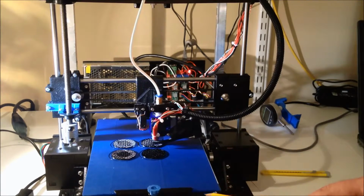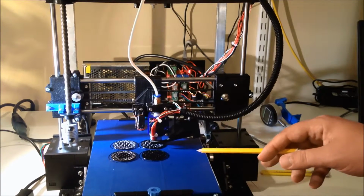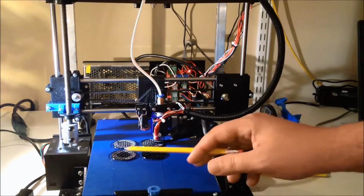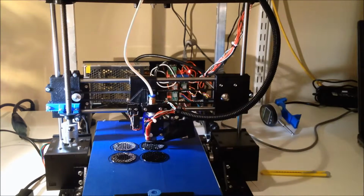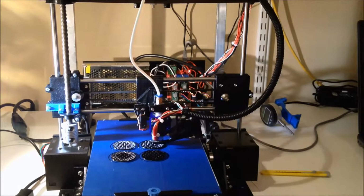I still have the problem that this melamine is warped in the middle a little bit, by about 0.3 millimeters, so I do have a sheet of cardboard in the middle, real thin cardboard, to kind of boost up the glass here. And I think I've done another video of these hold downs for the glass. I still have to epoxy the nuts on the bottom. It dried while I was epoxying the other stuff and didn't make it, so I got to mix up another batch.